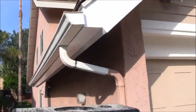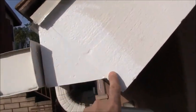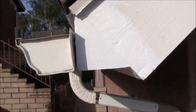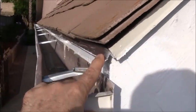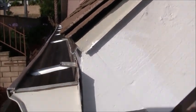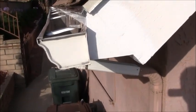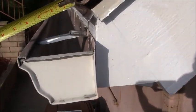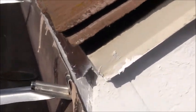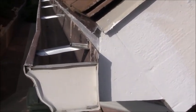This is on the other side of the house — a finished gutter I've already completed. You can see the original fascia is angled, so I built it out so that it's flat, giving the gutter a place to attach. I took the drip edge — this metal here — and brought it out a little bit so water drips directly into the gutter. Here at the end of the run I've got about four and a half inches of opening, and you can see the hidden hanger system installed all the way down instead of spikes.